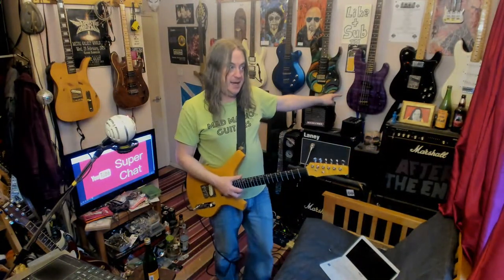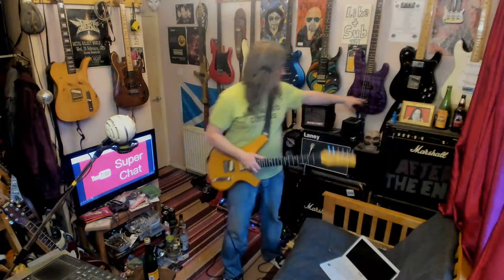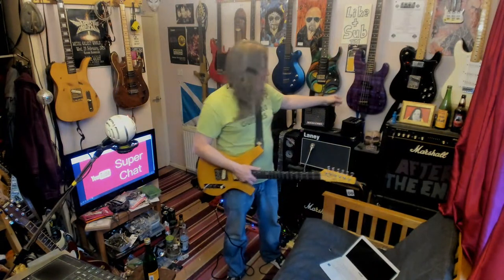And what I did was I put an extra socket on the front here, right? So when there's nothing plugged into that socket, it's just a PJ bass. It works exactly the same, but I used an amp socket on it so that when you plug into the front, it's like when you plug your headphones into your stereo, it cuts out the sound from the speakers. Basically, the actual socket has a terminal on it that's closed. When you stick a lead in, it sticks to one side and then disconnects the output. So this goes to the speaker, and this is your headphones: when you stick it in, it disconnects this one, but it connects to the amp.